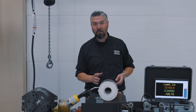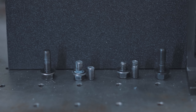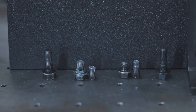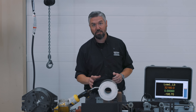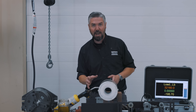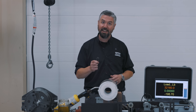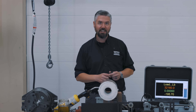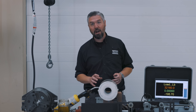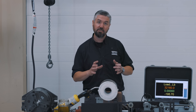So there you have it. We got our baseline grade 8 bolt out of the box with really good performance, and you can see the difference that different heat treating methods have on the strength of the material. You can get a picture of the science behind what's actually happening and the engineering that goes on behind every bolt you interact with every day. Let's talk about what's really happening on a molecular level without getting too complicated — how steel gets strengthened.